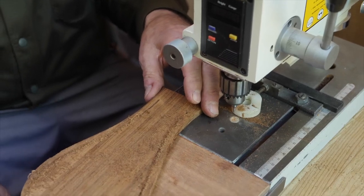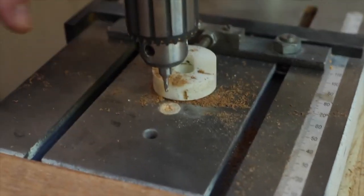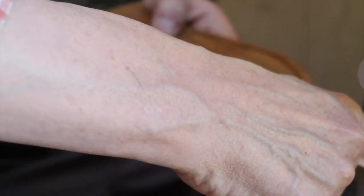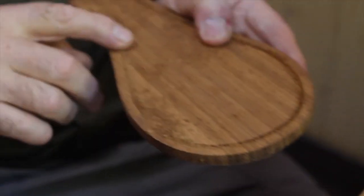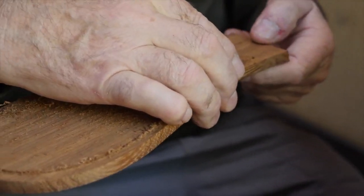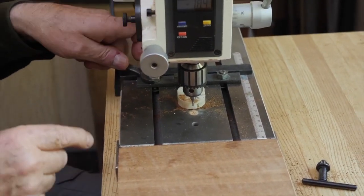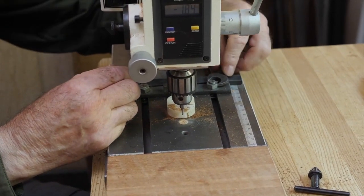So a really important bit is that white bush. Did you make that yourself? Yes, that's just a stop. That's a quarter of an inch. It's fairly average, but a quarter of an inch gap between the edge of the bush and the centre of the drill. It's what looks right, really, and then that comes out about right. I'll do both cheeks, and then change this fence for the next part.